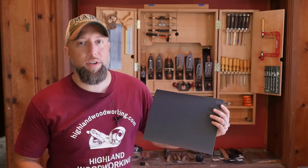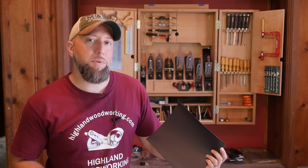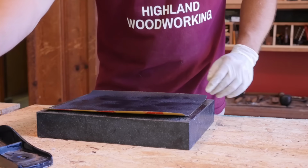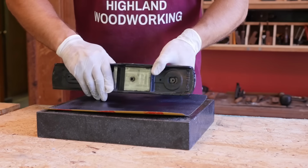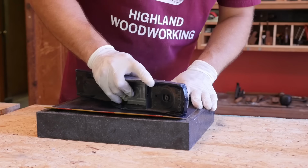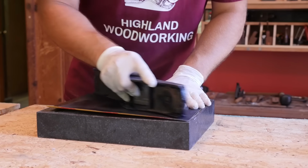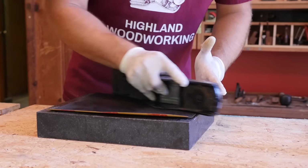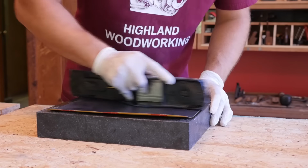First up is sandpaper. Now, you can use standard woodworking sandpaper like aluminum oxide or garnet grit, but that paper is designed to be used dry. Wet/dry paper stands up to water or solvent better than standard sandpaper. Sanding wet using either water or an oil or solvent reduces airborne sanding dust and helps to keep the paper from loading as quickly and is often a first choice for sanding off rust. The higher grits of wet/dry are made from silicon carbide. The silicon carbide grit particles are harder and longer wearing for sanding metal, and the paper can hold together longer when using it wet.